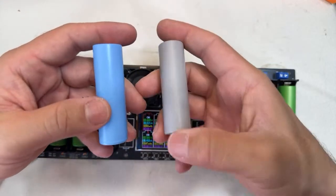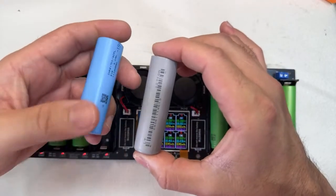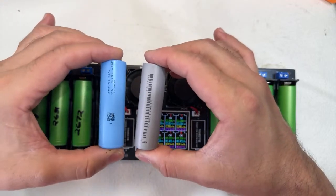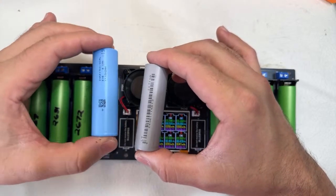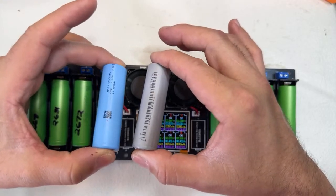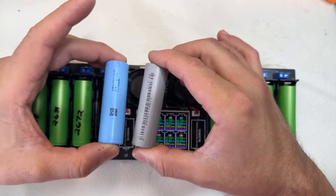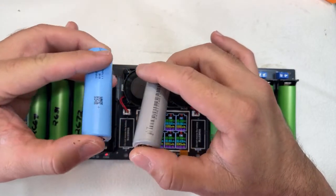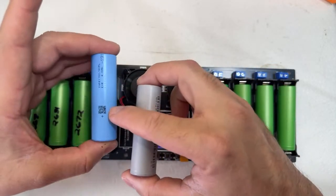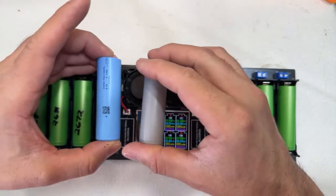So this is the JP40. Actually, this is the most powerful cell right now in the market. Period. But this one is right on the toes of this cell. Both of them are 4 amp hours. This one is 70 amps discharging rate. This one does the same. This one does 18C, that basically is 72, 2 amps over the EV. But honestly, that's marketing. In my opinion, both of the cells perform very, very close. In fact, the EV performs even better at lower temperature than the JP40, discharging at the same rates.